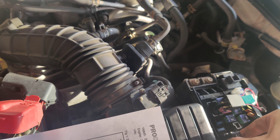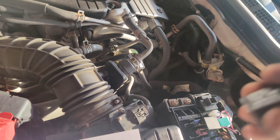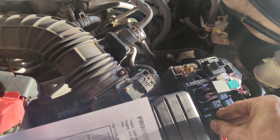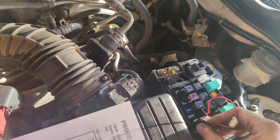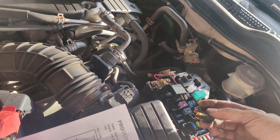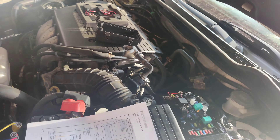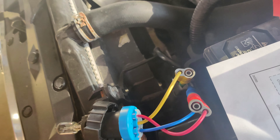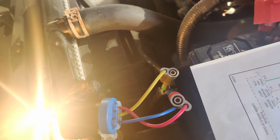Let's check the other one. This one has something flopping around in it. So now we're gonna need some new relays and we'll need a radiator fan. I could have sworn that one was stuck when I first pulled it out cause I think my headlight turned on. So we got two bad cooling fans — crazy. I'll disconnect the connectors, just make sure there's no visible issues. There's nothing stopping the fan from turning, so yeah I think we just got two bad fans.